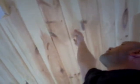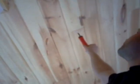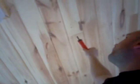Another problem we noticed while observing this tongue and groove sealing is that at some points where there were butt joints, like here, where you didn't have a long enough board to span the entire width of the ceiling, where these butt joints meet, the installers didn't caulk them or get them tight enough, or they shrank over time. So right now, this one's probably not the best example, but we have one in the other bedroom, major point of leakage. Try the next one here. Here's another one, not so much. When we go into the other bedroom, I'll be able to show you a better example. But again, we did all the tops of these windows as well.